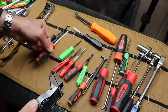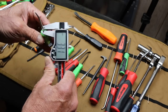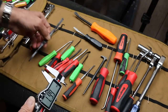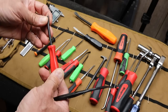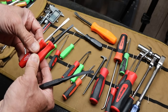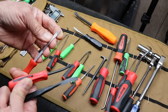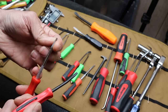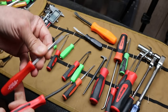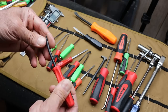For another comparison, some of the older ones — I'll use this pick, which goes down to 3.3 millimeters. Here's the Mayhew Cat's Paw, a little thicker — about 3.5 millimeters. Now, the reason for a smaller pry bar: obviously you're prying smaller things, it's handy, it's narrow. Yes, it looks like a screwdriver. So why not just use a screwdriver as a pry bar? Well, you certainly can — everybody does it — but you can damage the primary use of a screwdriver, which is to drive slotted fasteners. If you bung up the end, it transfers that mess to the screw head or just doesn't stay in. It impedes its actual value as a screwdriver. This one you could use as a screwdriver, but its primary purpose is a pry bar.